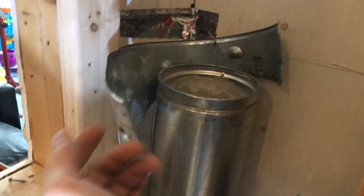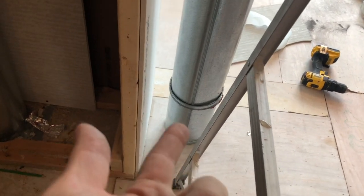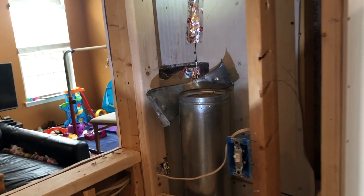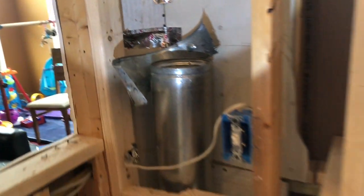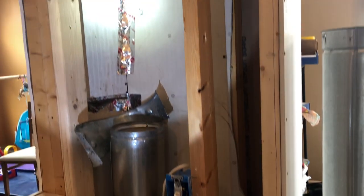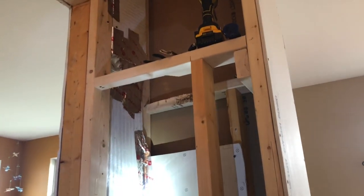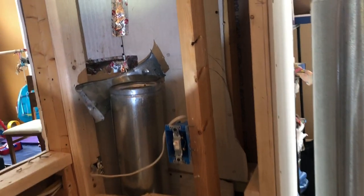I don't know what kind of rig job he had going over here — he had them connected backwards. There's a sleeve and you actually lock this piece in one direction, not the other, and I don't know what he had going on. I'm going to have to fix all this. I fired him and didn't pay him a penny. Anyway, any professionals watching, please leave some comments to help the do-it-yourselfers. I was told by someone who does this for a living that as long as you're an inch away you'll be good. Thanks for watching — give me a thumbs up, and go install your B vent.